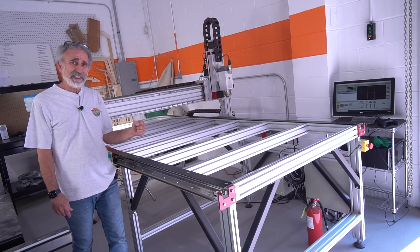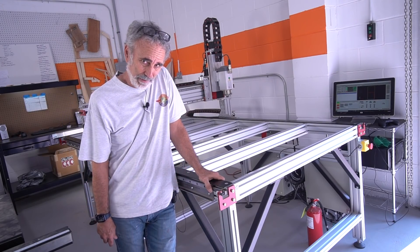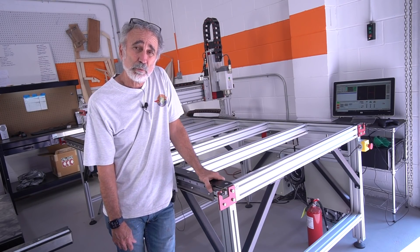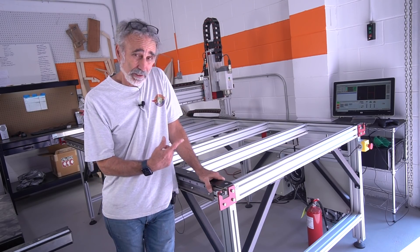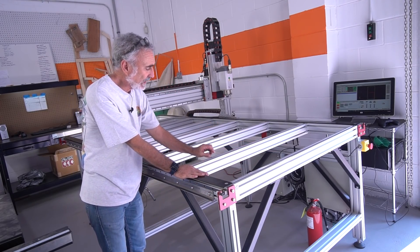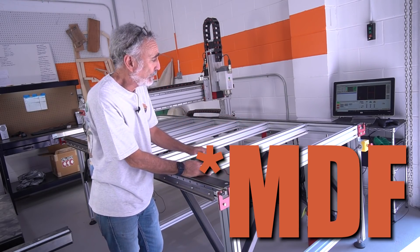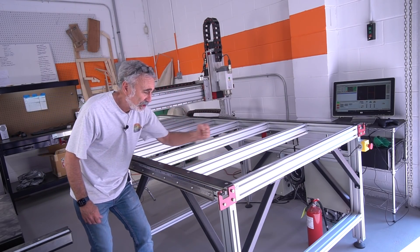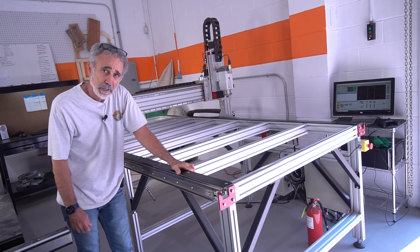I have been talking about this CNC machine for a good long while now and it's finally set up and running. It's been sitting here in the corner begging to be turned on, and Ron got this thing running — it was no easy task but he did it. He's out at the depot checking on their stock of spoil boards. A spoil board is basically a four-by-eight, one-inch piece of melamine. We put that on to cover the whole tabletop and then the machine comes across, smooths it, cuts and trims it smooth all the way across — all one level, all one plane.